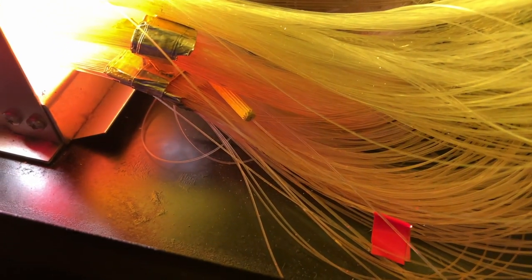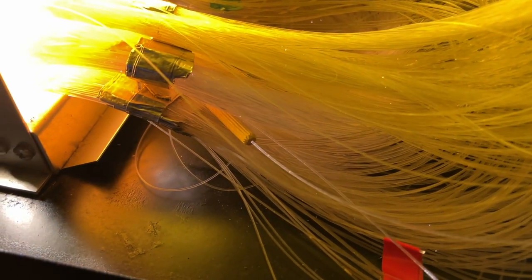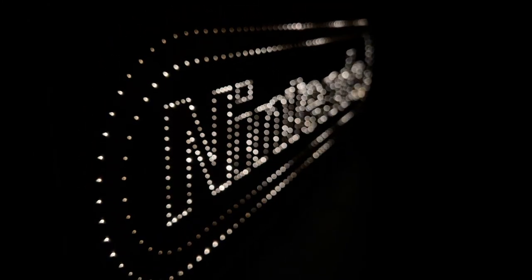Let's show you the result. Here's a view of inside my sign — I'm going to point with this chopstick. There's the splice — you can see light passing right through. Unfortunately the break happened way at the base of this bundle so you can't really see the source fiber, but you can see the output coming out that end. The two ends have been polished and are flat and they're doing their thing. I haven't taped it yet just because I wanted to show you what it looks like — I could easily just pull this out. You don't want to do anything you can't undo easily. Let's take a look at the front — that's what matters most.